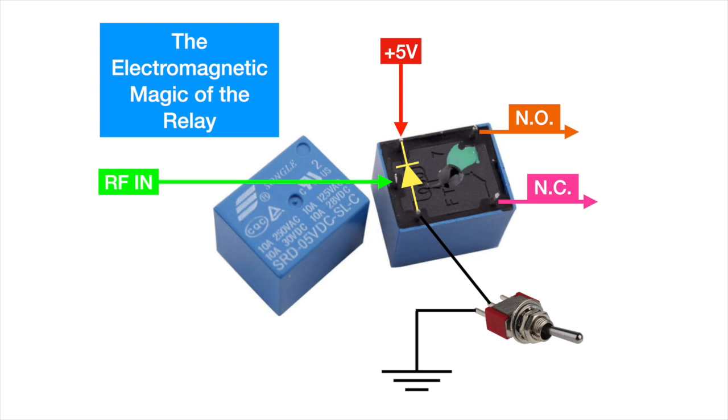You could actually just do this — have a switch on the front and do exactly as you can see it. The reason I'm not doing that is that I want to do more, because the problem is: if I did this in my radio, sure enough when I flip that switch I would change bands, but that's all I'd do. My VFO would still be set to give me a frequency in a certain band — that wouldn't shift. I've only changed the bandpass filter, and there's the danger I could end up transmitting with the wrong filter in. I need to swap the filter and also swap what frequency I'm on, and that means using a microcontroller — an Arduino Nano.